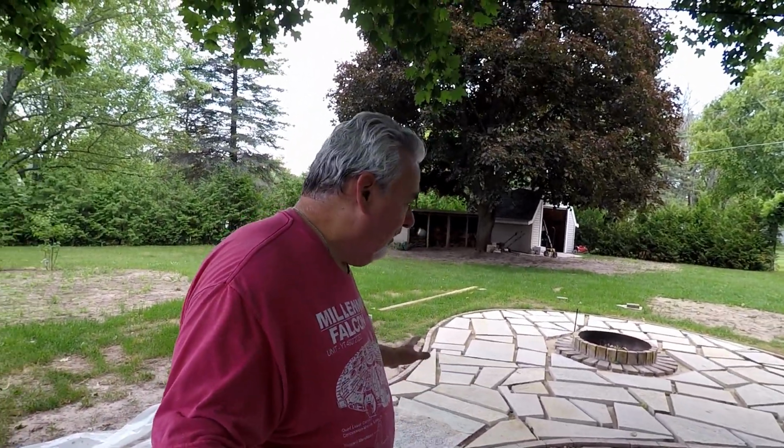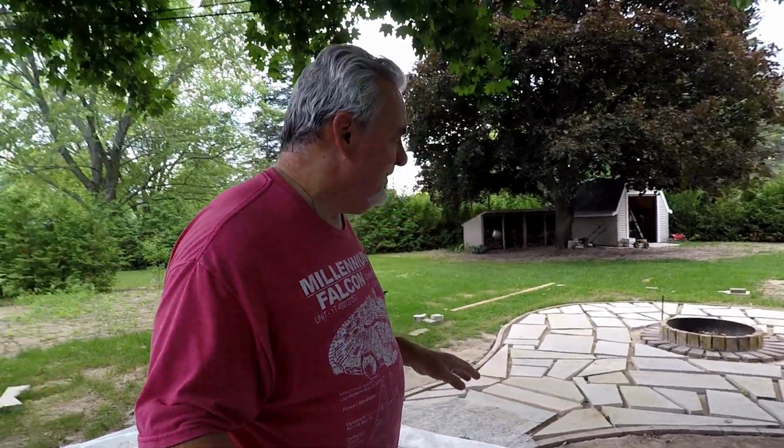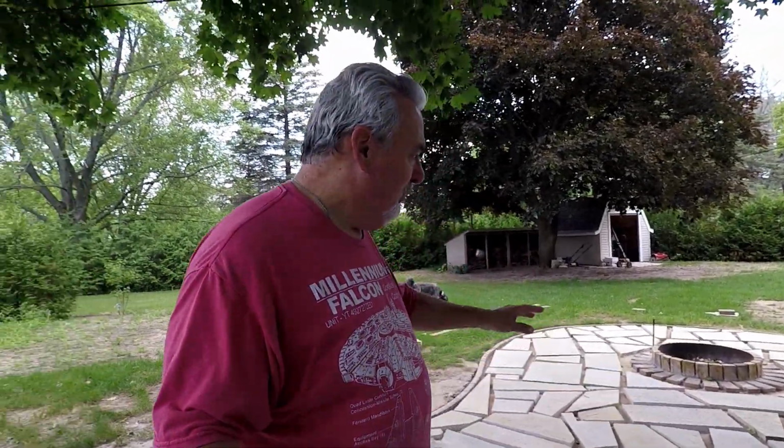Well, the day is finally here that we get to wrap up the fire pit patio project. Last night, we got through laying the final block in. We also sprayed insecticide all over the blocks and the sand to kill off beetles, ants, whatever is in there. It's gonna kill them off so they're no longer in that area. Today, before we start laying the quarry wash down, we're going to clean up all of the leaves and whirligigs that fell in overnight. Then we're going to water down all the sand and the stones, not heavy, just lightly, and then start applying our quarry wash.